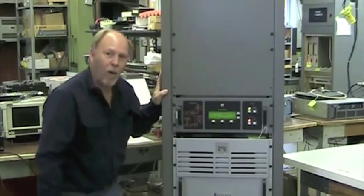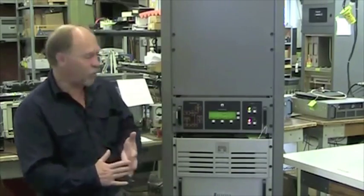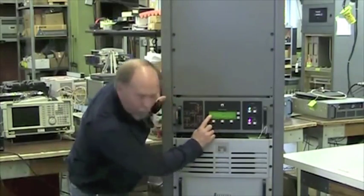To increase power on this transmitter, when you first receive it, there are 6 presets. If you have notified the salesman of what you want for power, those should be set up with the exception of 1. We try to ship the transmitter with 1 preset at 0 power. So when you first turn it on, there should be no power. I will show you how to increase that preset as well.